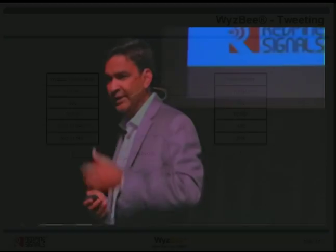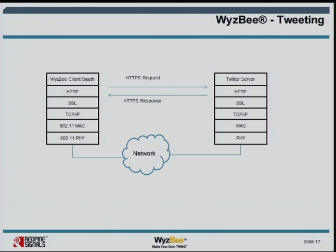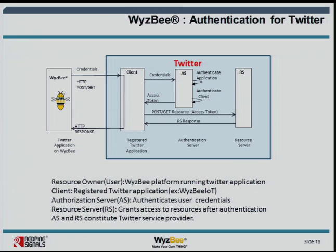When you pull the data, the application that I have inside the microcontroller interprets it and does whatever is required. So for example, we say WSBI IoT color red. That is the message that goes to the application registered at the Twitter server. This sensor application pulls the data from there, interprets the data, and controls the local circuits. You have this in your deck, in the presentation slides you are getting. This is how it works: WSBI communicating with the registered application so that I can pull the data and push the data to the Twitter server. This particular application we are demonstrating here is on the light. That means basically nobody is involved, just the WSBI platform, a 4G hotspot, and the Twitter server.